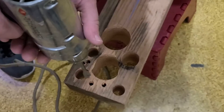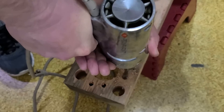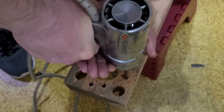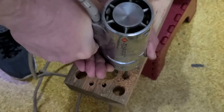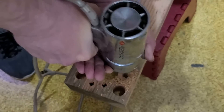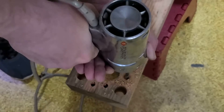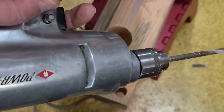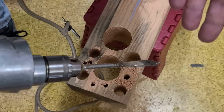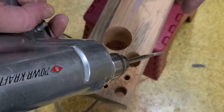A sleeve bearing 2.2 amp thousand RPM drill is surprisingly weak, so I'm just using a half-inch spade bit because that's about all this thing can handle. You could hear it was really bogging down, having a hard time with that. You could probably do five-eighths or three-quarters, but you'd have to go lightly, really peck at it, and it would be slow going. One inch would basically be too much.